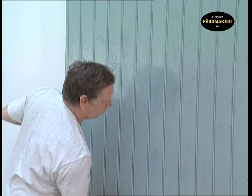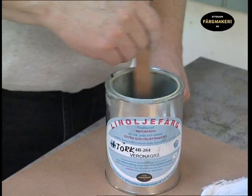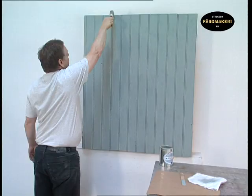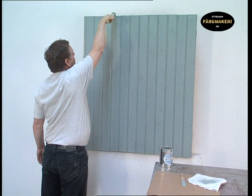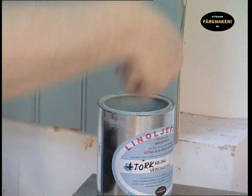When the paint is completely dry after about two days, sand the panel once again. Wipe away any dust before the next coat and stir the paint before you start. The final application is similar to the previous one — work the paint thinly and evenly with repeated brush strokes. Start with the tongue and groove joints and finish off each panel with long and even brush strokes.